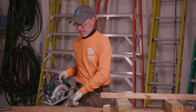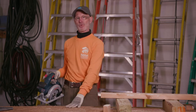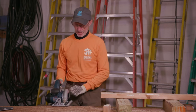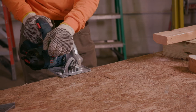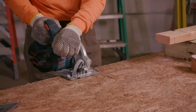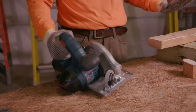And there we have a cut. Another typical cut that you might see with a circular saw is when you have a piece of OSB or plywood and you want to make a cut. Say this is my cut line and I'm going to cut across the table. You make sure your work is supported so that when you cut it, this board does not move. In this case I'm putting both hands on the saw. I can start it, I can see my cut line and my guide for my saw blade, and then you just cut.